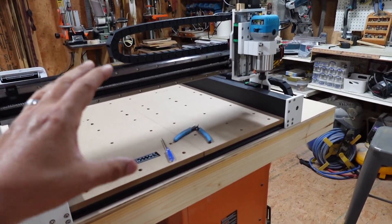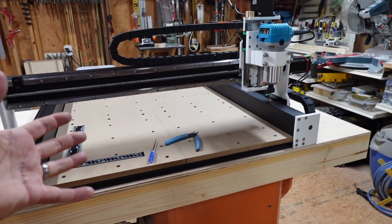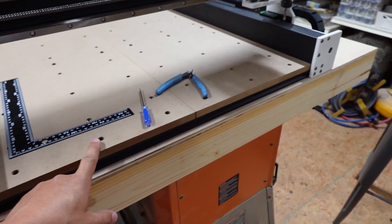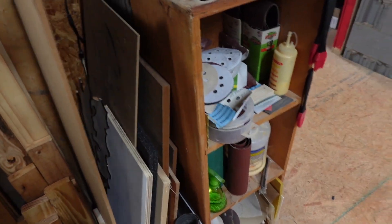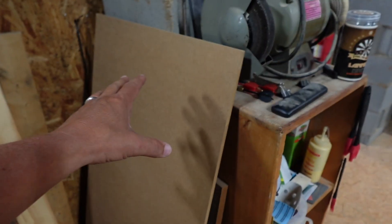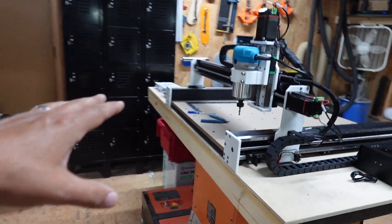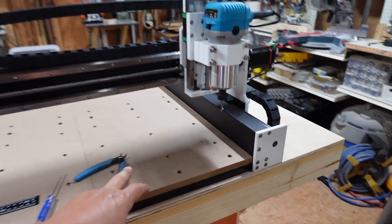There's something I've been wanting to make, and we're going to use this machine to do it — we're going to cut some templates for some skateboards. Stay tuned. We're going to come back tomorrow and do this project. The only other thing I might do is put on a spoil board. I have a couple pieces of MDF here. I think I'll do the double tape method, glue these down off camera, so we'll have a spoil board because I'm going to be cutting all the way through and I don't want to ruin the bed.